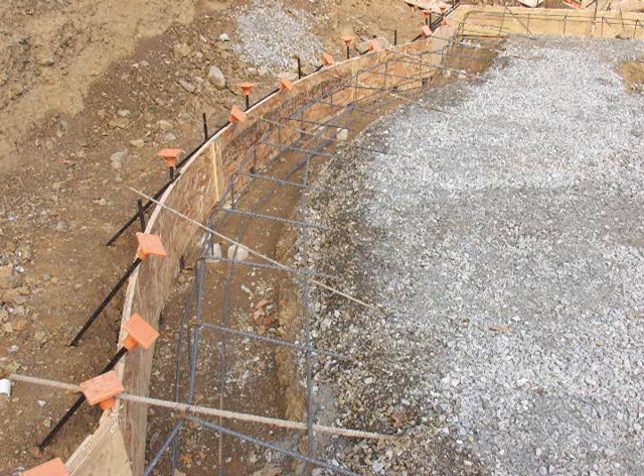Finally, you'll have to run the rebar in this curved section. You could use a rebar bender to curve it as nicely as possible, but it's really not that important. As long as you have the rebar basically in the shape that you want, that's all that matters. We actually come in here with a straight piece and just bend it against our knee as we move around that curve, which gives us close enough. It's never going to be seen — as long as we keep it away from the edge, it'll be structurally set.